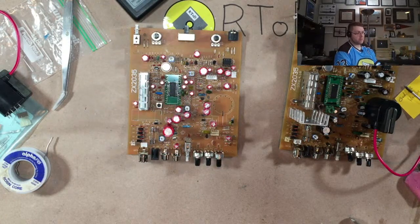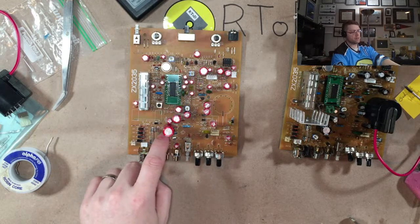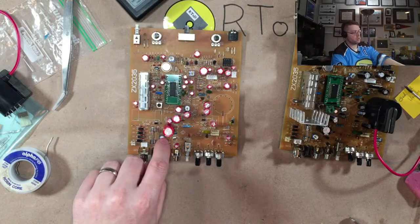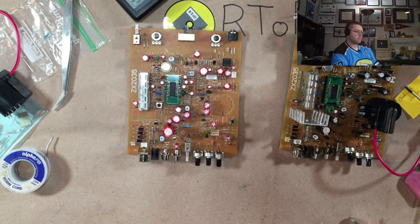If not, then I think we're going to look at some of these adjustment pots as suspect, because his Reddit handle is Jano, and there's a bunch of numbers, but I'm just going to call him Jano. He took these out, and I should have tested it before I put them in, but he took them out, hooked them up to his meter, and he would adjust the pots. Nothing would change, right? It just wouldn't change. So he definitely has a faulty one on W4. So, doesn't mean that mine's bad, right? It could work, but it's just something you want to keep in mind. So that's the next suspected issue.